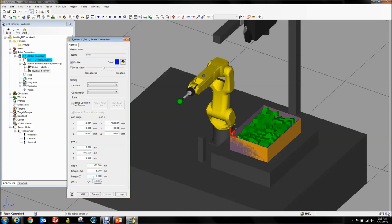What it's going to do is keep the tooling we just defined away from these walls. We can also add a little buffer from the bottom. This is why it's nice when you teach your frame to the corner of the bin — if you can't do that, at least teach to the top of the bin so you can keep these numbers easy.